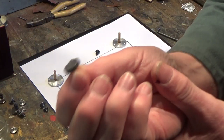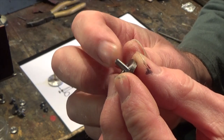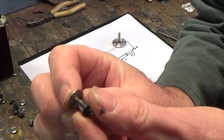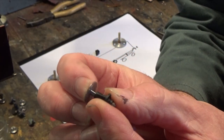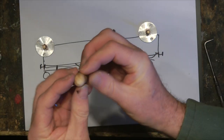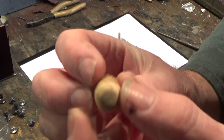I've got the basic part turned - turned this down from a half-inch piece of steel bar, put a little thread in there and made the buffer. The buffer then fits in here and is sprung as well, so that looks a lot neater. The other thing I've done is made a piece of dowel just polished up to represent the dynamo.